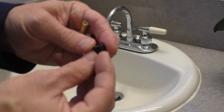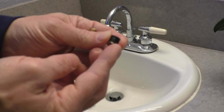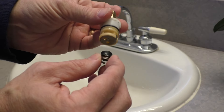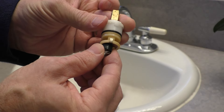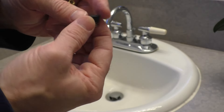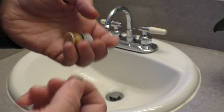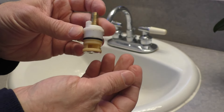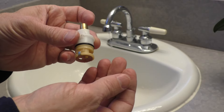Also commonly, they come with these kind of base seals and sometimes even a little spring. Once inserted, it goes on the bottom and as it turns, it kind of turns the water on and off through these holes. So your issue may be this base seal, or it may be the cartridge itself. They typically come in packages, so you might as well just purchase them as a package.